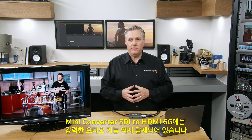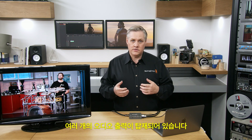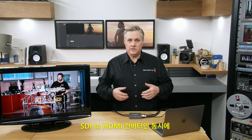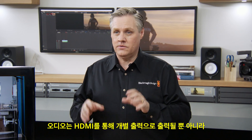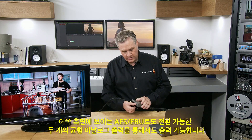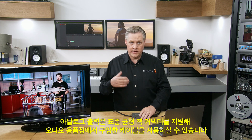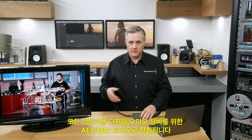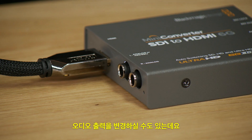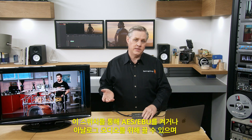Audio is also a big thing. The mini converter SDI to HDMI 6G has powerful audio features — it includes multiple audio outputs, not just audio on the HDMI output. In many ways it's not only an SDI to HDMI converter but also a Pro Audio de-embedder. The audio has output on the HDMI as independent outputs, and also on two balanced analog outputs on the side that can be switched to AES/EBU as well. The analog output is on standard balanced jack connectors, so you can use cables from audio stores. When switched to digital audio, the output is AES/EBU for all pro digital audio gear. You can switch between AES/EBU or analog on switch 8.